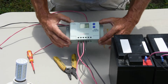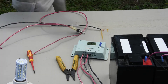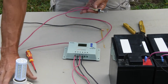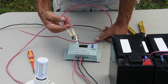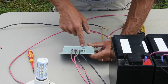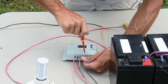Now you can see the charge controller is coming up. The battery only has 11.3 volts, so I'm going to go ahead and connect the solar panel to it. Now with the solar panel connected, it's showing the battery is half charged at 11.6 volts. I have the light fixture with our little 12-volt LED corncob light — I put a toggle switch in series with the positive wire going to the light so we can turn it on and off. I'm going to hook the positive to the load side — you can see on this end it says load positive and negative.